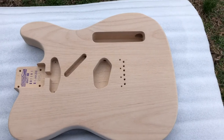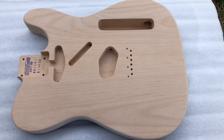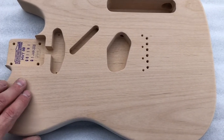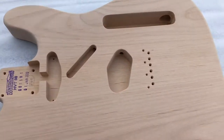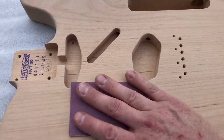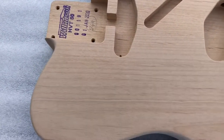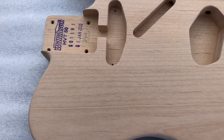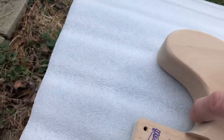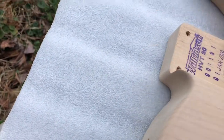I'm back and I have gone over this entire guitar body with some 320 grit sandpaper. It does come pretty smooth, but there were a couple slight scratches in the body, so I took some 320 and block-sanded it. Make sure when you are using your sandpaper you're going with the grain — you never want to rub across the grain. Going with the grain will make sure everything is smooth when you're ready to apply your finishes. You do want to get inside the horn area; I noticed it wasn't to my satisfaction from the factory, so I spent a little more time there.